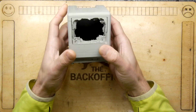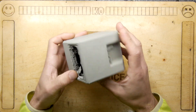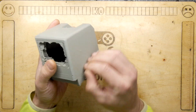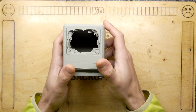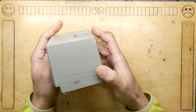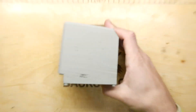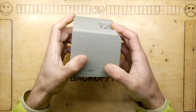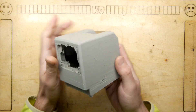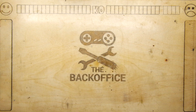Following from my printout of this little Mac SE, it was almost impossible to clean up the supports. I've discovered that Cura - the slicer program that takes your CAD model and slices it into all the lines your 3D printer can print - prints a very thick support on my Anycubic Chiron. You can see it's so thick you can't punch it out. It was a failed print, and with old filament and still dialing in settings, after 10 hours I'm just going to throw it in the bin.